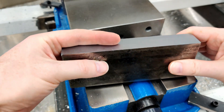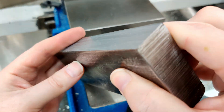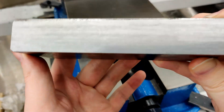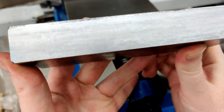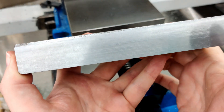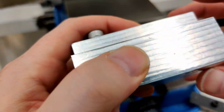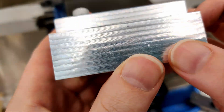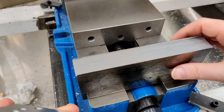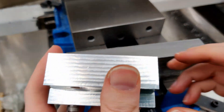You can see there's absolutely no reflection — well, there is at the right angle, but barely anything. You can see the tool marks, and they're similar to the aluminum. On the aluminum one it's way easier to see. The spacing is similar just because of the feed and speed, but going through the steel I can go a lot slower than with aluminum.